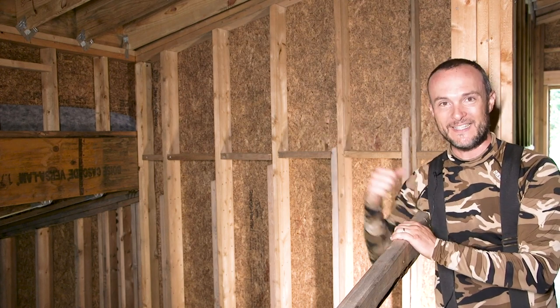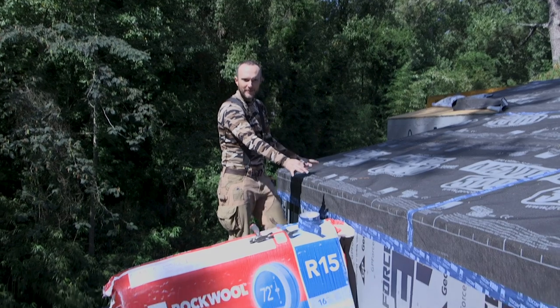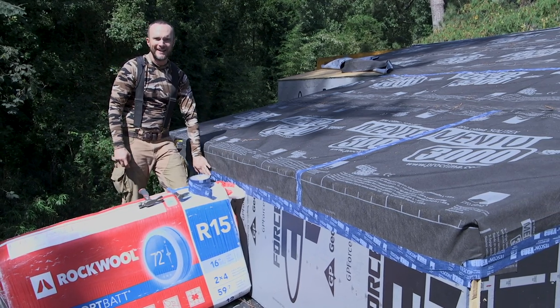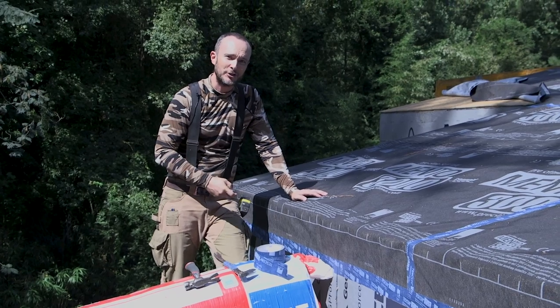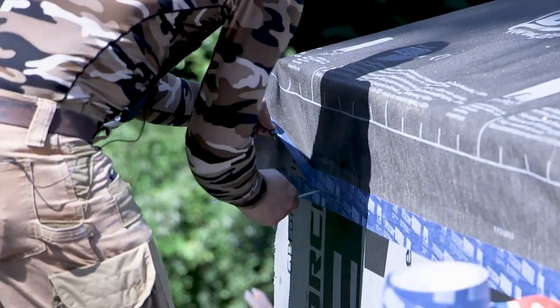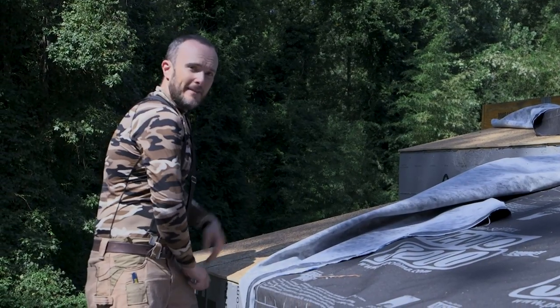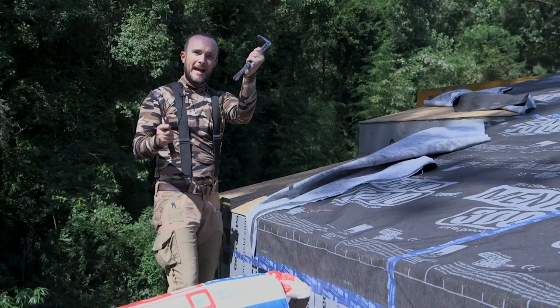So let's go up on the roof and see how we fix this. Here we are on the outside of the dormer we were just looking at, and this is where that cavity begins. This black shroud is our air-tightness and water-tightness layer. And this tape that I put on here Friday night at 9 o'clock in the dark — which is why I forgot to do this, classic builder story — is going to stick for 100 years, unless you use a knife to take it off. I've now exposed the entirety of this piece of roof sheathing that I need to remove.